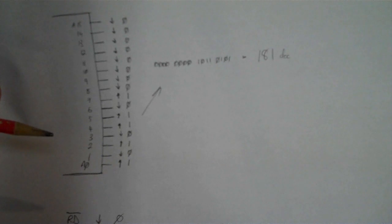So when it wants to assert a bit, it will bring it to a high voltage state, which in the case of the Z80, or TTL logic, is plus 5 volts or thereabouts. And if it's in a low state, or a zero bit, then it would usually be run between half a volt to 1.25 volts, I think.